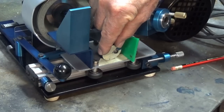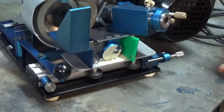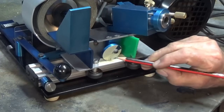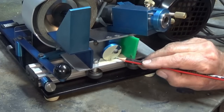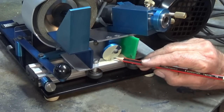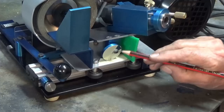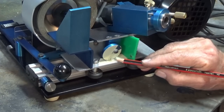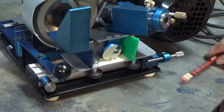Then you rotate the eccentric around till it stops moving. Mark that position with a pencil, and then I was going to scan that part, and from the scan I create a CAD model, and from the CAD model I can create a cut file, and then we could engrave the surface of that disc there using a CNC drag engraving tool. Now it was all going really well.